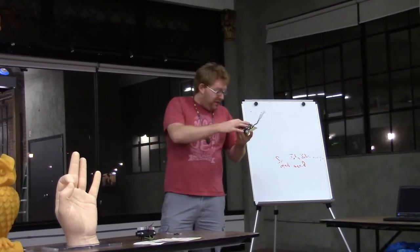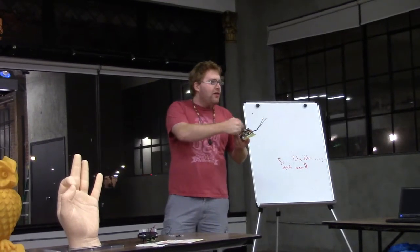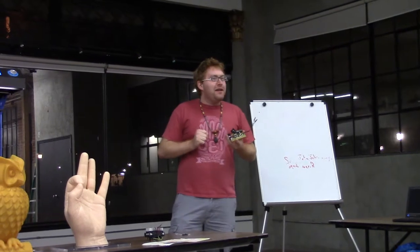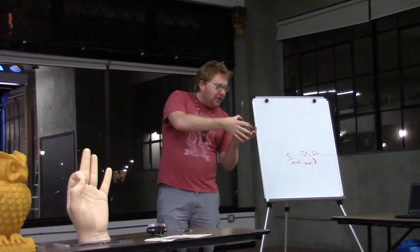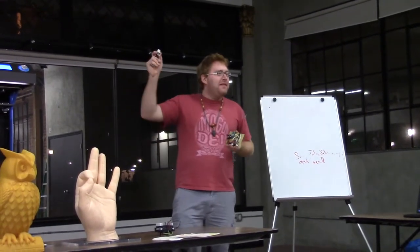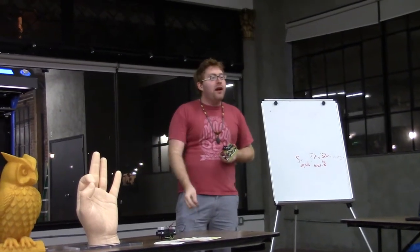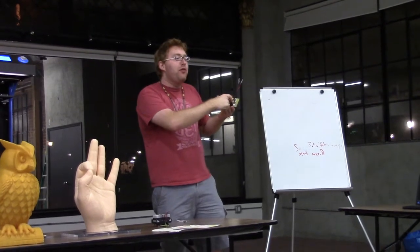Turns out this guy can control all sorts of currents, and based on the supporting little components and lots of data sheets, you can figure out how to get the current you want. In my case, I want exactly an amp. And then this little circuit here is an Arduino circuit which talks to this really easy to use fingerprint scanner and reads my fingerprint and determines whether or not it should pulse width modulate the enable switch for this.